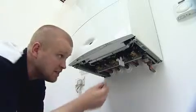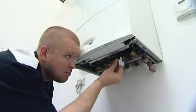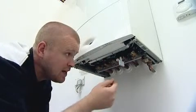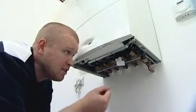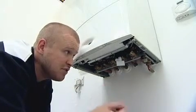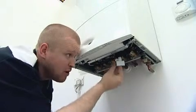So what I'm now going to do is begin to tighten this plastic spindle knob back up until I can actually hear the water stop. What I'm then going to do is turn the key back to the open padlock position and remove the key. Now before I remove the key, there's a chance there's going to be a little bit of water that comes out — that's fine. So if you've got a bit of paper or a rag to mop that up, that's fine. If you do find however that the water continues to come out, do make sure that this spindle knob has been tightened up properly.